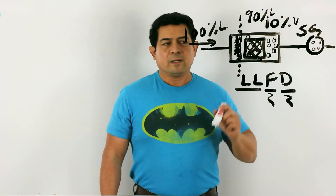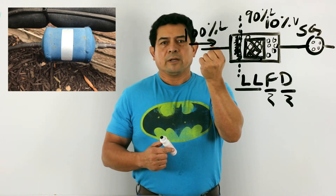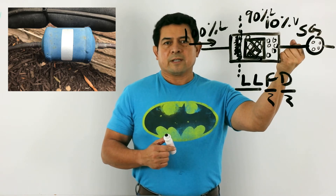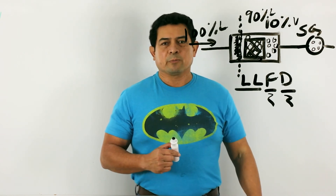That's the best way to tell whether your liquid line filter dryer needs to be replaced or not. It does not take much — grab the liquid line on one side of the dryer and then grab it on the other side. You feel a temperature difference and then you know that dryer needs to be replaced.